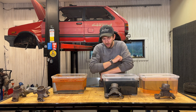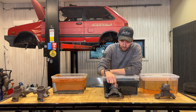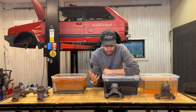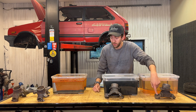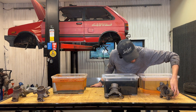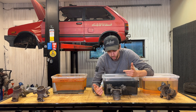But to be fair, there is one true winner here, and that is the Evapor-Rust. That is just flawless. The only thing left on this piece is paint, because it doesn't touch the paint. Also, the bushing is in mint condition still - nothing happened to it, neither in the Evapor-Rust nor in the vinegar. The vinegar didn't do much - it did do something, but not much.